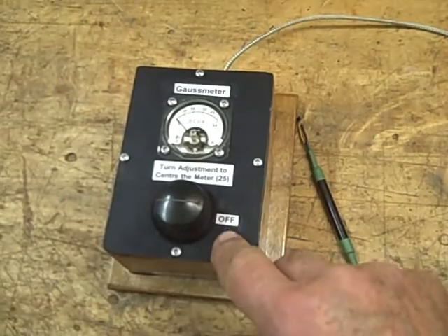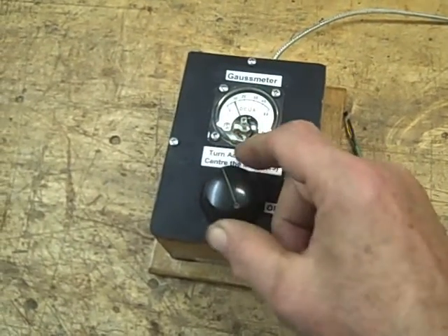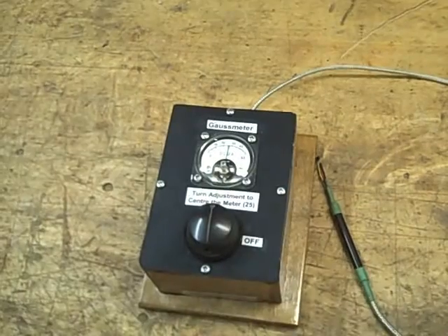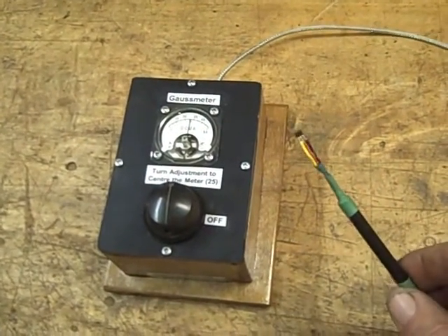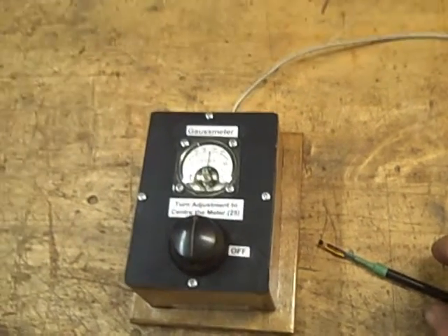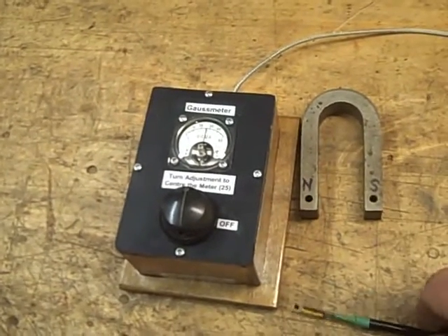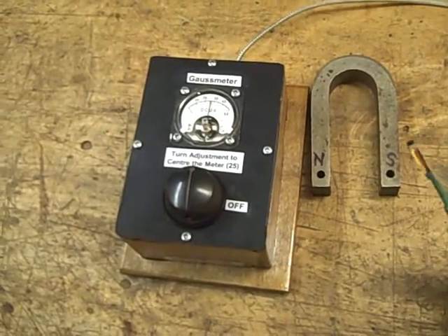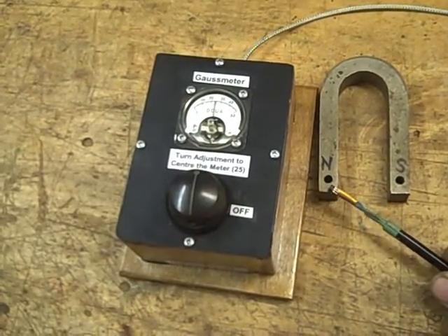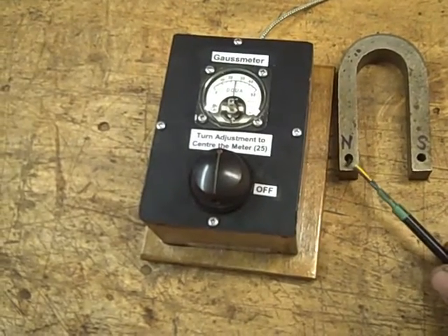It's relatively straightforward. I've got it set so that there's an on/off switch on the control. To get the thing going, you can see that the needle is on zero, and if you turn it on you adjust the control so that the needle in the meter is centered. The probe — the thing that actually measures the magnetic field — is that little tiny black thing at the end of the probe. Right now it's set to mid-scale, and if I bring a magnet over you'll see that the needle starts to deflect as I move the thing around, and that'll give you some idea of what the magnetic field strength is.